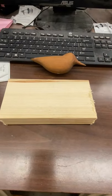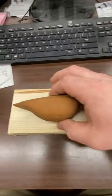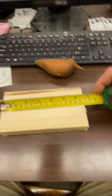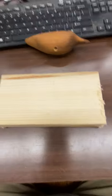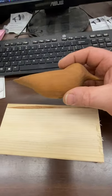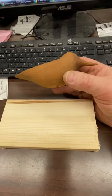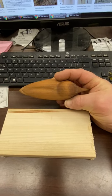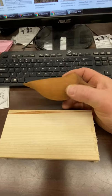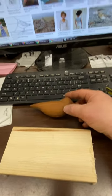We've got our little piece of two by four here that I'm going to use to carve this sandpiper. I cut this block about six and a half inches long — six inches would work too. What we want to do is trace patterns onto this block to use as guides. Those patterns are going to give us two views: the side view and the top view, which will be the same for both the top and bottom as well as both sides.